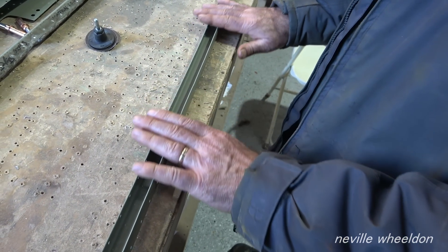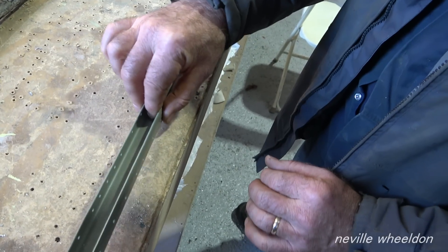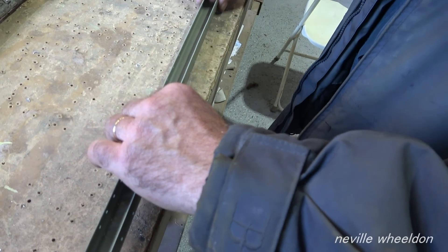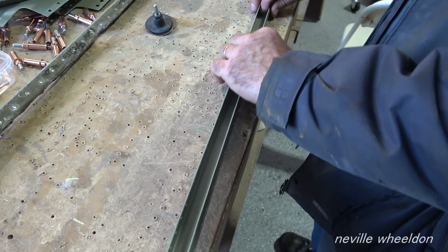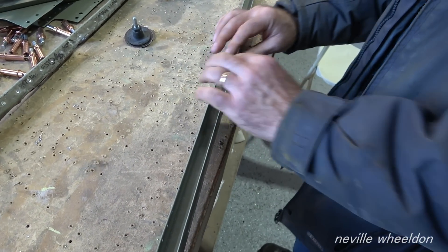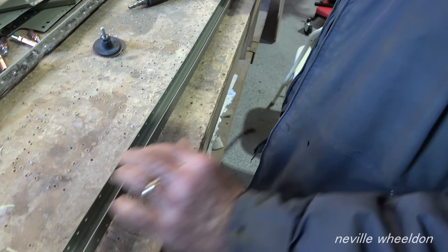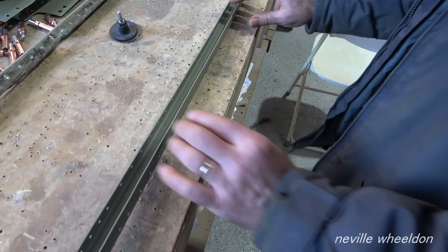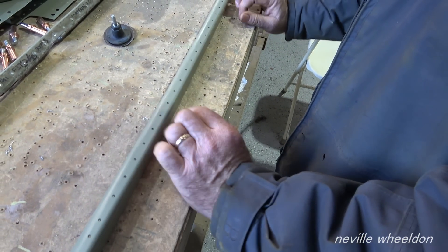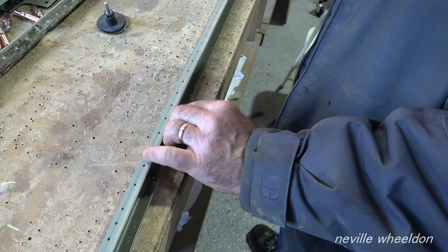Because there's too much material on there. But if you have a fixture where it's actually held in, then it can't go anywhere. And the centre one will do it — it actually forces it to do it, and it stretches this bit ever so slightly, without really damaging the walls. But the way this has been folded, Simone's put it in a shrinker too.